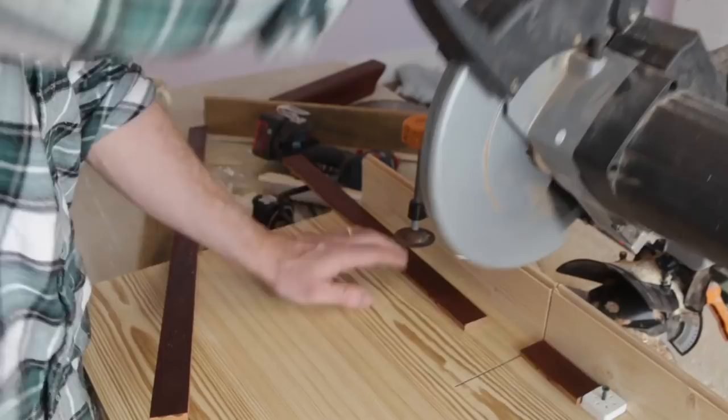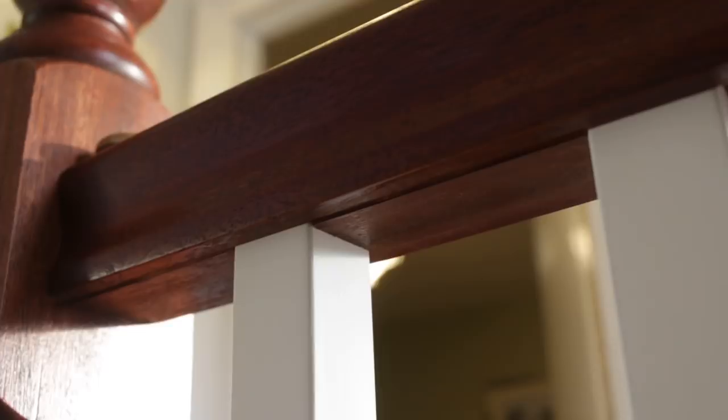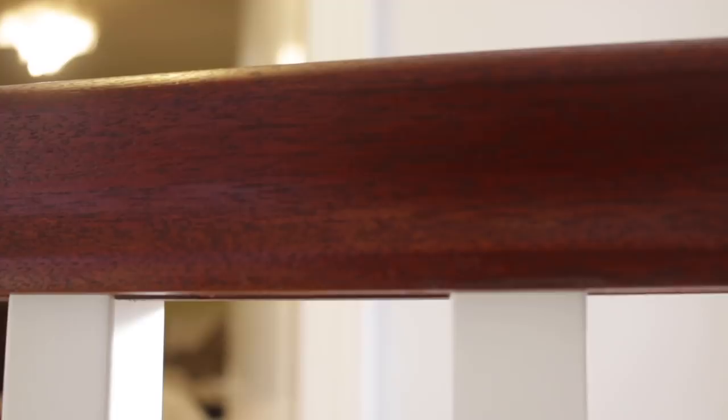This is pretty standard me being fussy, but the infill strips for the handrail should be 8mm, and same for the base rail I think. But if you have a look at it, it's not quite good enough — when you look up there, especially as we're coming up the stairs, you can see there's actually a slight difference between the height. It sticks down — probably less than a millimetre, but it's the sort of thing that's going to be playing on my mind forever if I don't do it properly. I'm going to take them down on the thickness planer and very carefully take off a very small pass so that they'll just sink in a little bit further into that rebate.